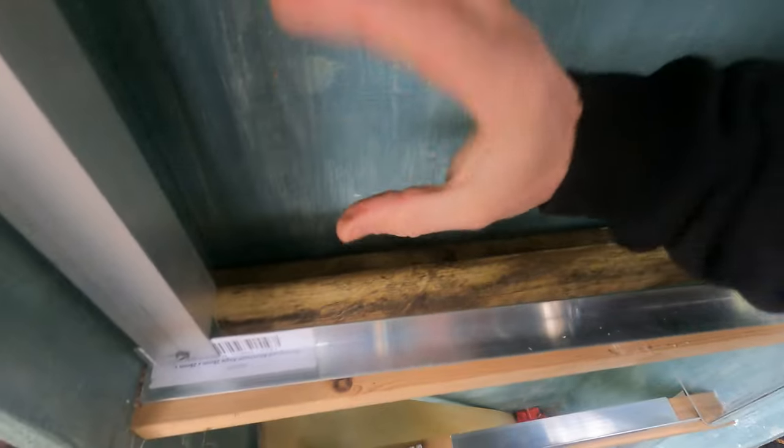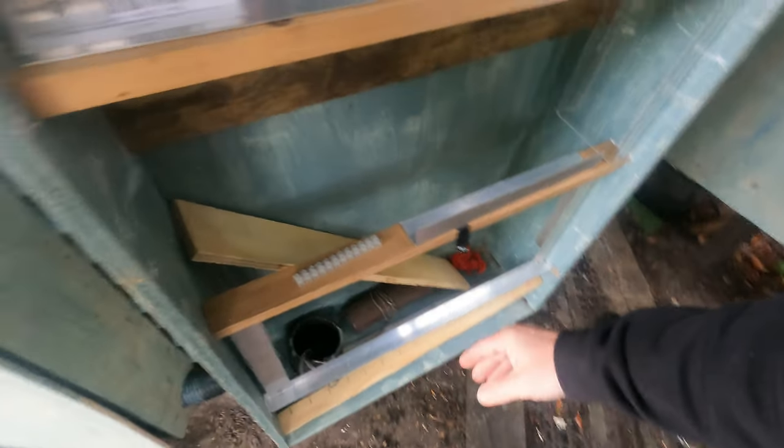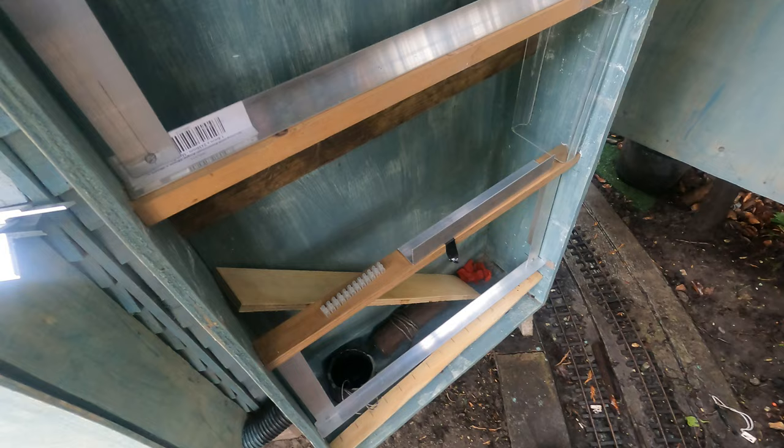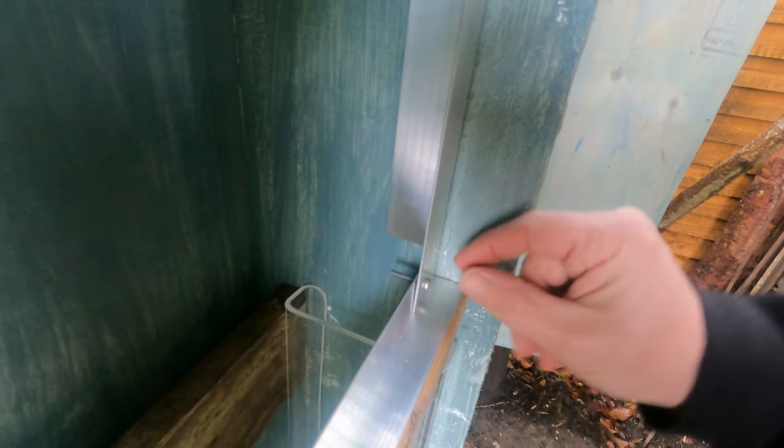To help cable management behind this bank of cable joining area, all the cables will go down the back to keep them tidy. There'll be another divider at the back further down, and there's a space at the bottom also as a cable tidy bay. For the time being, I've simply bolted these together using M4 bolts. What I will use are M6 bolts with captivated nuts at the back, so these will be very easily removed without losing the nuts. As this is all covered up at the front, I won't be able to get to the nuts at the back to undo that — the nut will just turn — so there'll be captivated nuts all the way down here, just the same as I used for the other station control box.